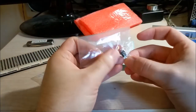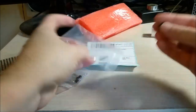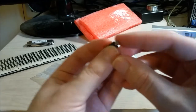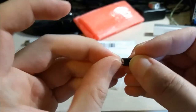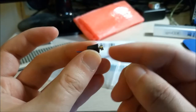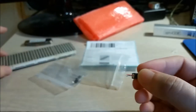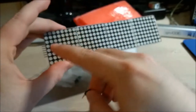I have another idea. If I could buy a whole bunch of these motors — these are essentially vibrating motors for phones. You know, when you get a phone call and your phone's on silent, there's a counterweight that spins around and essentially vibrates. I'm not going to be using them as vibrating motors — I'm actually going to make something inspired by flip dot displays. They're essentially mechanical displays with a matrix of pixels, where each pixel has a disc with one side black and the other side white. An electromagnet inside can flip the disc one way or the other, and it only requires power to flip. After you remove power, it retains the image — it's kind of like e-ink, almost.